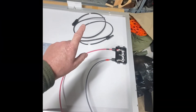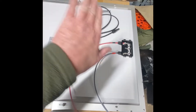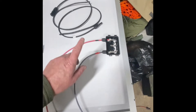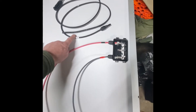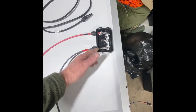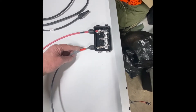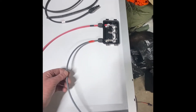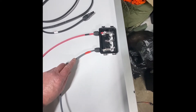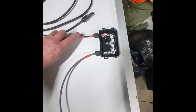I ended up replacing these wires because I repositioned the solar panel on the trailer. I didn't quite like it on the front nose cone, so I've pulled it to the middle. I've taken these cables out and re-soldered them into the solar panel controller. Because I'm using my extension cables, the ends are actually backwards — the black, which would normally be ground, is now the power, and the red is now the ground.